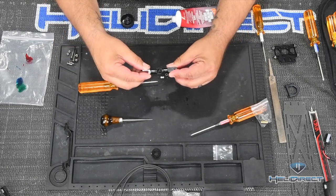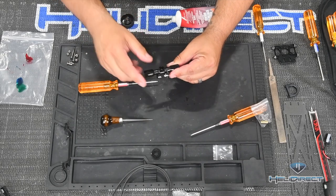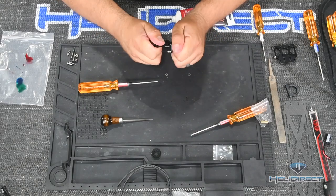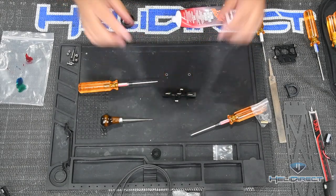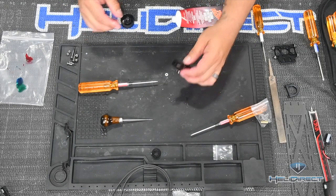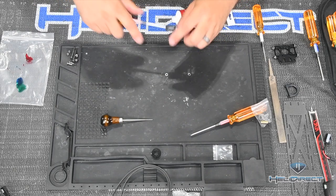And if I feel these blade grips kind of pulsing in and out, like there's a little bit of wiggle in here, then I need to add those shims. So let's see how we do. I think I'm going to add them. It's just a tiny, tiny bit of play, but I think I want to go ahead and add them, and at least see what it's like.